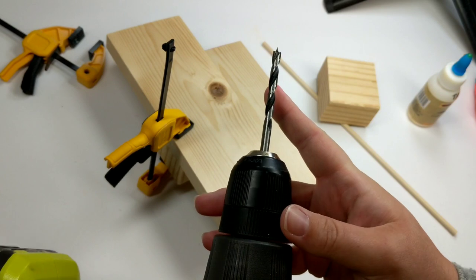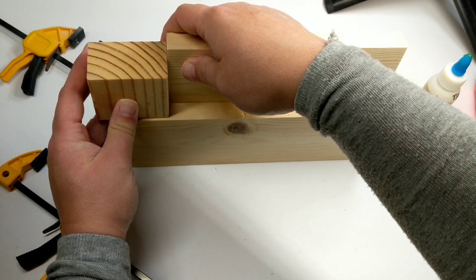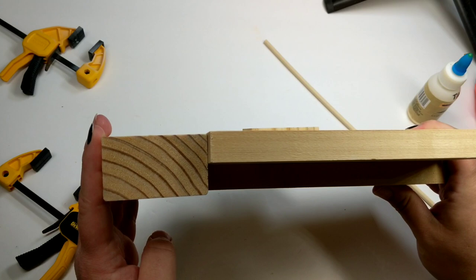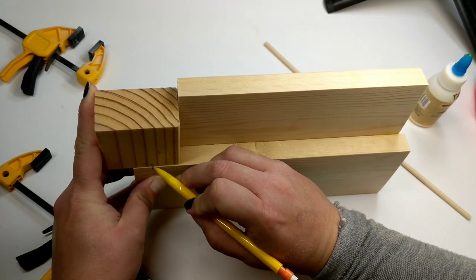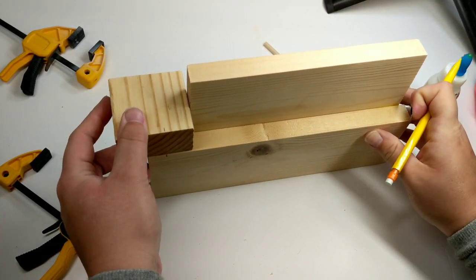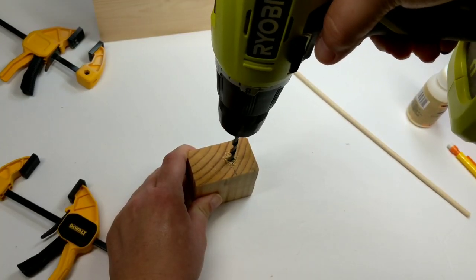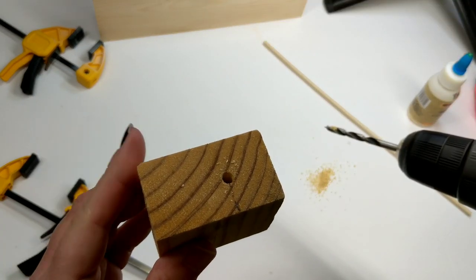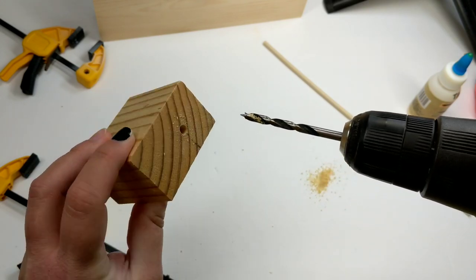The next day after this dried, we're going to add in our little piece using a drill bit and a wooden dowel. You want to make sure your drill bit is slightly bigger than the dowel. See how this little two by three just fits in that corner — there's no perfect system for this, but I wanted to create a definite connector rather than just wood glue.